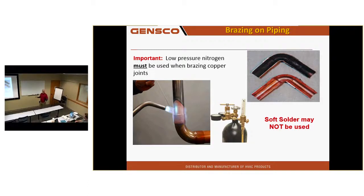They don't have more than a 5-degree temp split. And when I looked at the maintenance tool data, those 2 gas temp sensors should read pretty close to the same temperature. They're both the suction line. But in this case, on one system, 1 temp reading was 50 degrees, the other one was 75. How can I have different suction temperatures out of the same coil? And on the other system, 3 of them look like that, 45 to 50 degrees, and on the other one, 70 degrees plus. And I asked them, you got any bullheaded T's? Because that's all I could think might cause this.